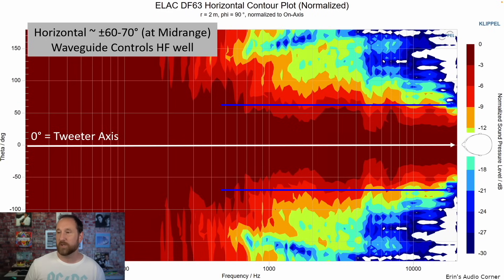This is the horizontal contour plot — you're looking at about plus or minus 70 degrees with the tweeter pointed directly at you. Through the one kHz to two kHz area, the mid-range is becoming more directive, and then they bring in the tweeter which is more omnidirectional — it flares out more. This is the reason I say the tweeter could have been crossed over a little bit further, which would have married these up better and created less of a jump. But looking at the negative six dB point, that jump is pretty minor, so I don't know if it's worth worrying about. It's also worth noting that the waveguide controls the high frequency pretty well — through here in the dark red it's almost flat, which is really good directivity control.